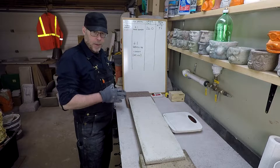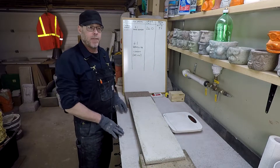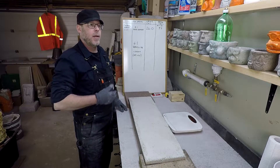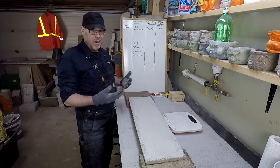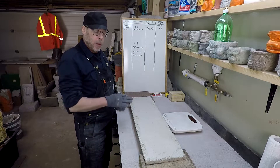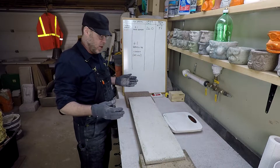This mix was a dry mix, and that matters because it affects consolidation. It's harder to consolidate a dry mix than a wet mix. However, when you over-hydrate a concrete mix of any kind, you compromise the strength. You don't want to use too much water, so it will be interesting to see where this falls in terms of the strength to weight ratio.